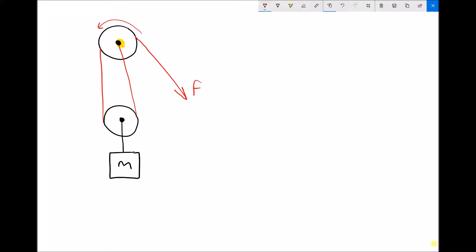When we apply a force F to the cable, we end up with tension in the cable equal to the force F. What we notice is that there are two passes of the cable between the two pulleys, so that force F results in double the force being used to lift the load. If we apply a force of 10 newtons, we have 10 newtons in the right-hand cable and 10 newtons in the left-hand cable, giving a total lifting force of 20 newtons.